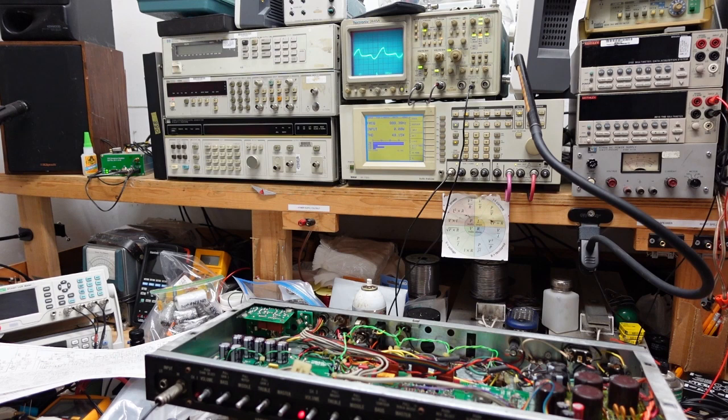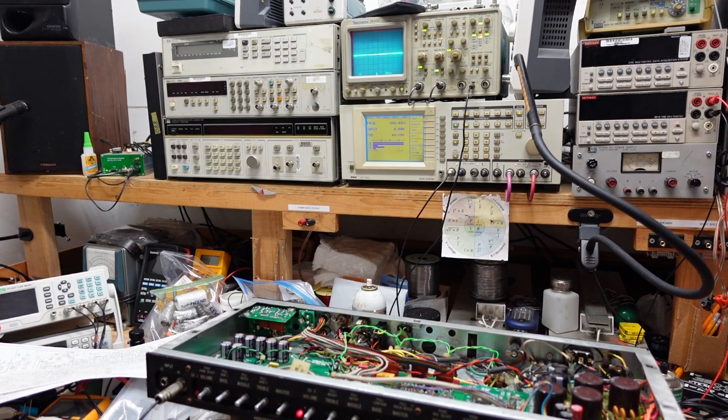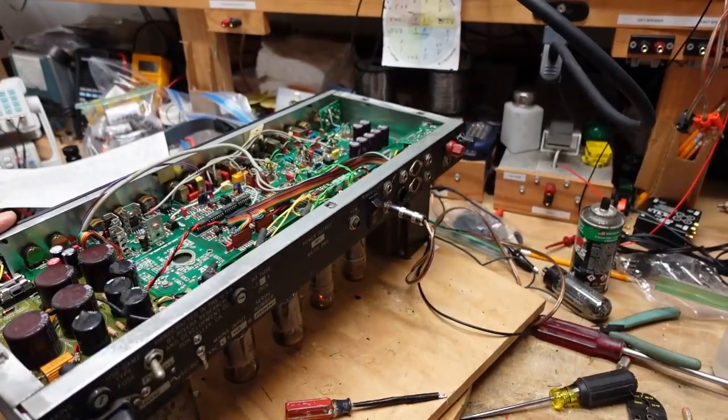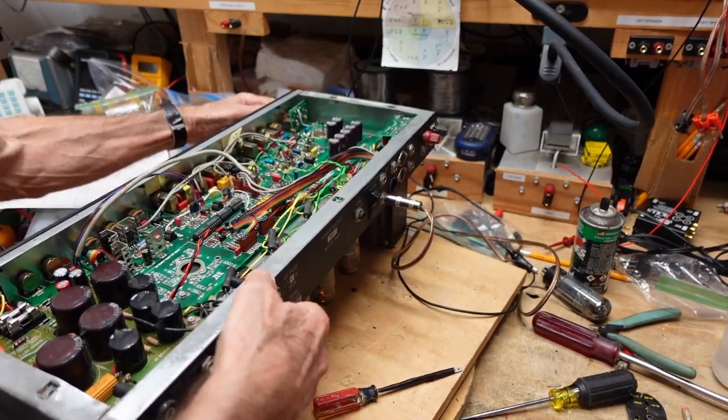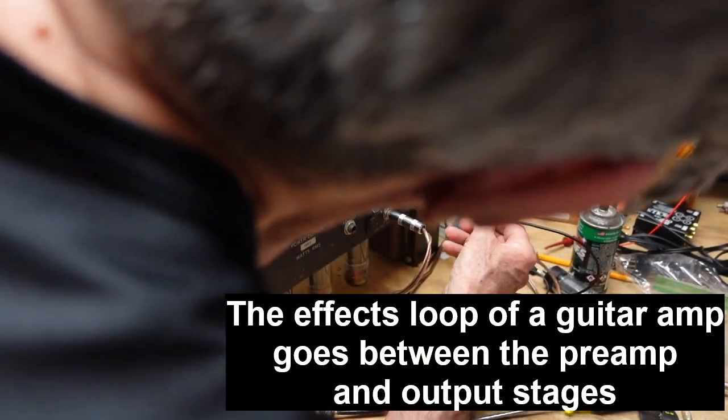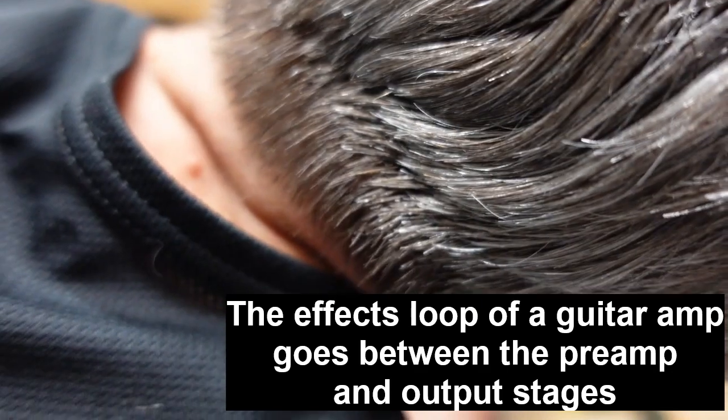Now, there's something that people who've watched my channel have seen me do, and that's when you're working on something like an integrated amplifier or a receiver that has pre-main jumpers, that is preamp output, main in, so you can break the link and put in an outboard processor, equalizer, what have you. That's a great way to test to see where your problems lie. And in this case, we can do basically the same thing by looking on the back here and putting our signal into the effects loop. Okay, the effects loop return to be, all right, this is our return.